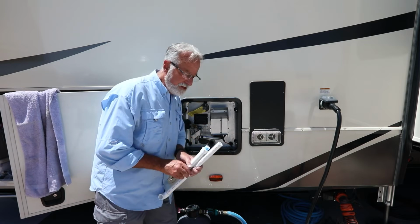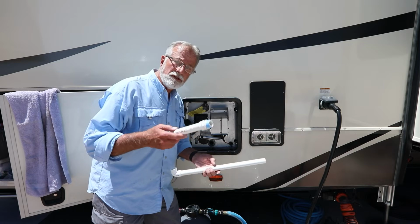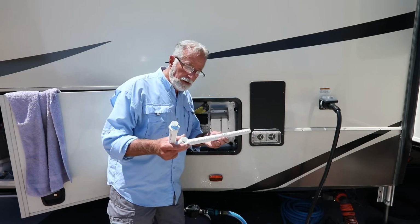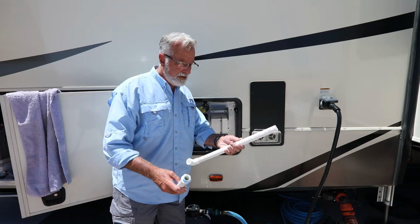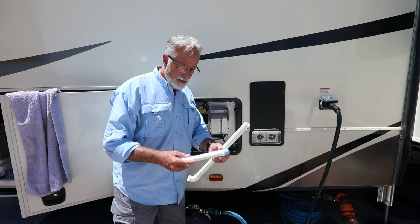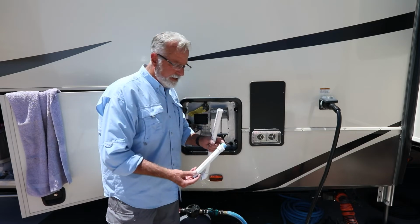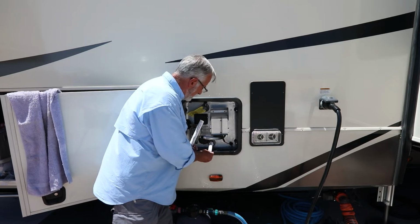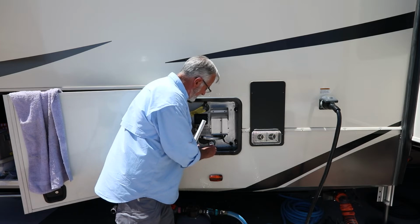Okay, the next thing we're going to do is use 4 pieces of PVC, 3/4 inch, just standard white. I use Schedule 40 PVC, a 90-degree elbow. This was at one time one section. Cut off 3 feet, and then I chopped it down to make it far enough to reach out, and a threaded fitting on this end, with a little Teflon tape on it to go into where the anode went so that I can fill this tank.